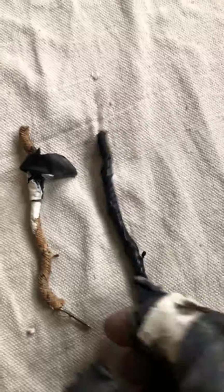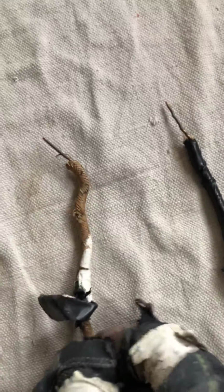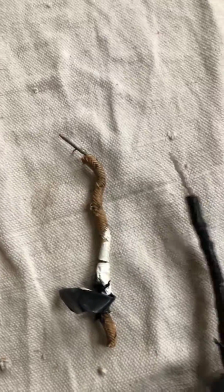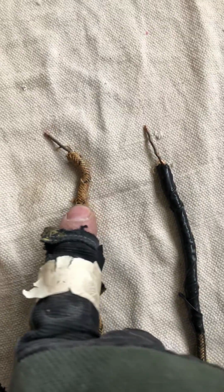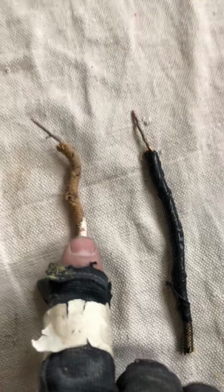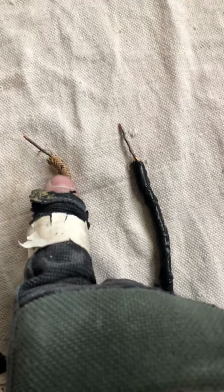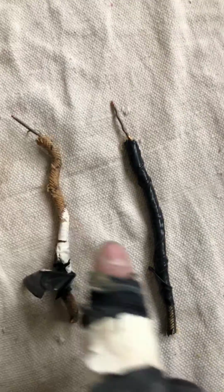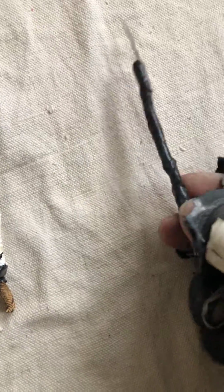Over the years, these are what's in our light fixture boxes. That's your black conductor. Here's your white conductor. All right, now if the system was 100% clean and safe, that cloth, that's pretty nice. Like most of the time this cloth is gone. It's dry rotted and cracked out. This one, it did already dry rot, and that's why there's electrical tape on it.